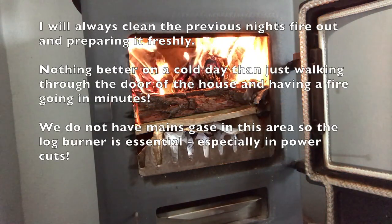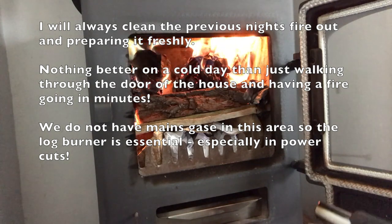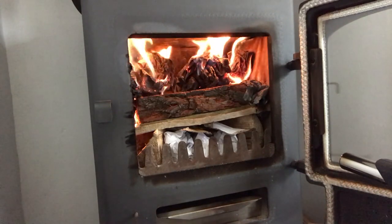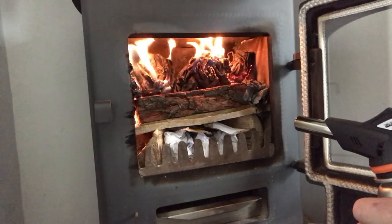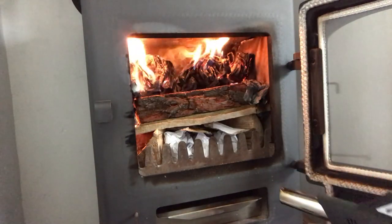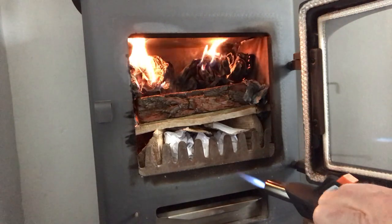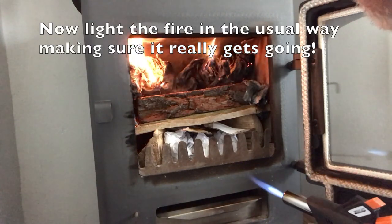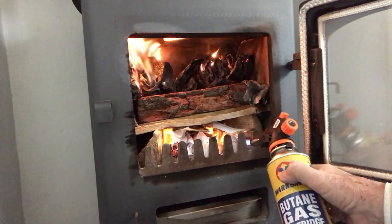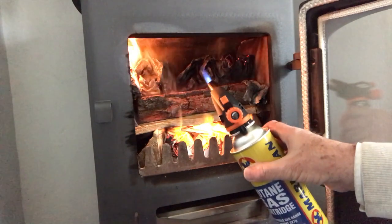I'll be feeling the flue as time goes by, checking whether it's really heating up. It doesn't have to be too hot, but as long as it's going to give us the best start we possibly can. Now we'll get the bottom going. As the top dies down, we don't want the flue to get cold and that cold air to continue coming down, so we'll light the fire as normal now that we've had a top fire up.